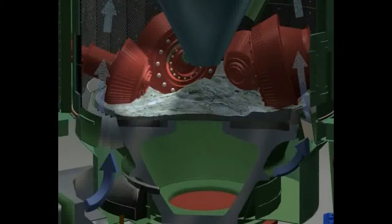These ultra-fine products, in the form of dust clouds in a highly aerated condition, can only be kept under control by taking special precautions. The grinding bed is de-aerated and compressed by small preparation rollers. The actual grinding is performed by large grinding rollers under the application of high pressure.